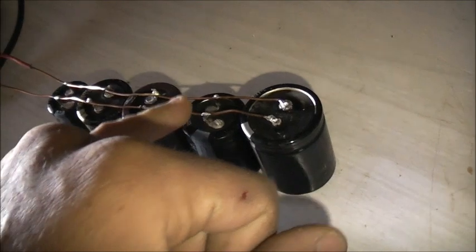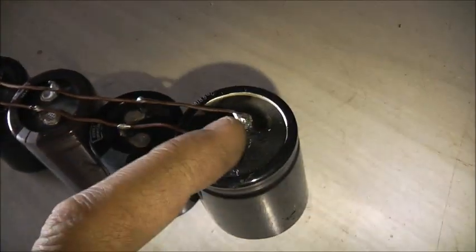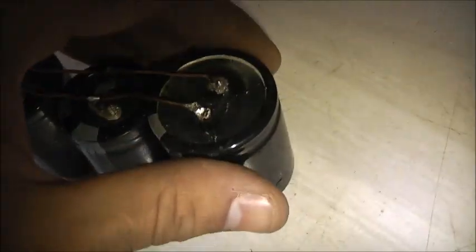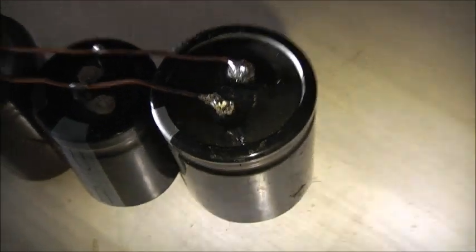Okay, here's our little bank complete. If these little solder lugs are snapped off, these capacitors are pretty much useless because you just cannot solder them — it's very difficult to solder to the aluminium rivet at the bottom. So it's best to carefully remove them with desoldering braid off the circuit board.